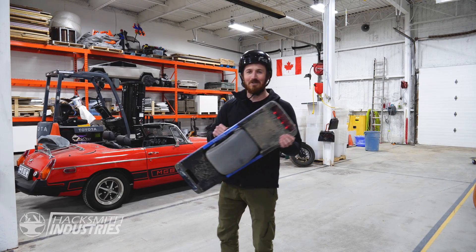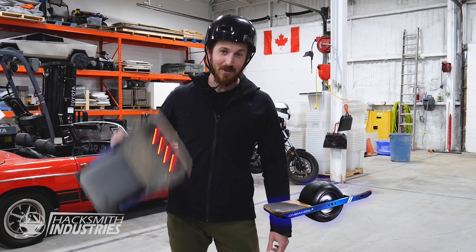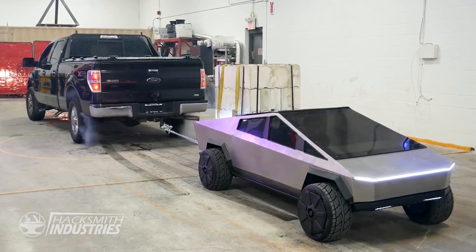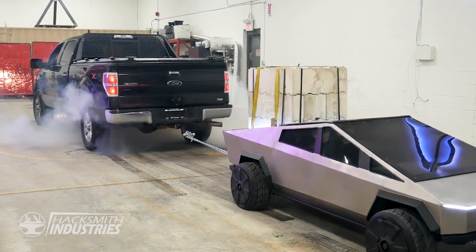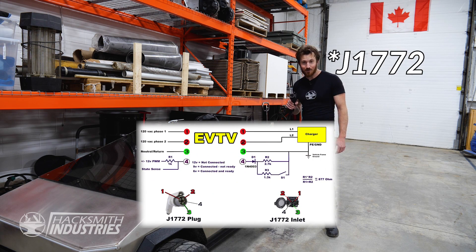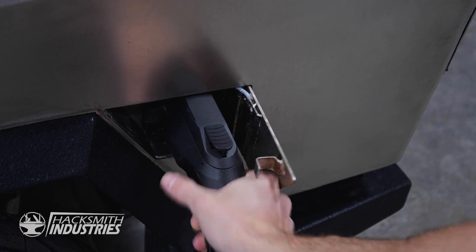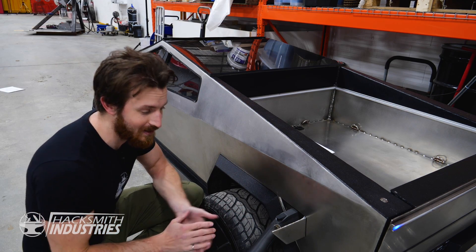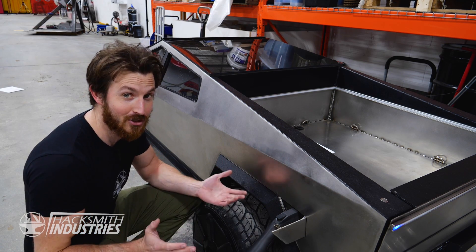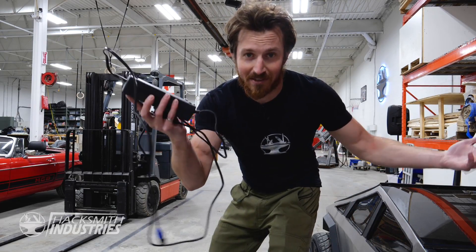But it really sucks if you're out on a long ride and you're running out of juice. It's pretty heavy, so in this video I'm going to show you how you can recharge your OneWheel at an EV charge station. We recently built a half-scale Cybertruck, and while building it we learned about the electrical standard for EV charging — specifically the SAE J1772 charge port. This plug puts out 240 volts AC, but it has a protection circuit with an extra pin that acts as a signal wire. If we can fake that signal wire, we can charge our OneWheel, since its charger already accepts 100 to 240 volts AC. All we need to do is make the adapter.